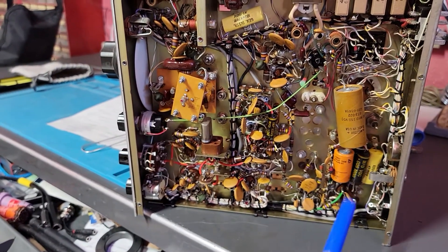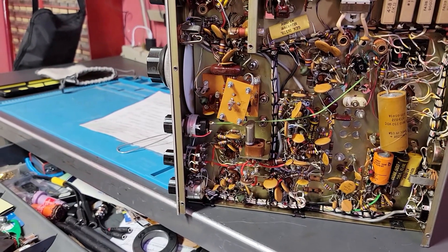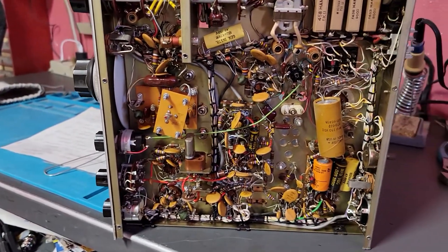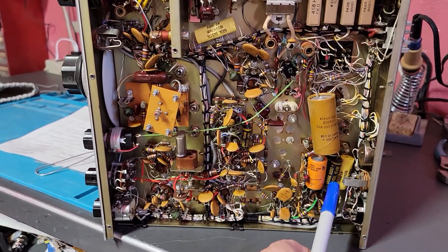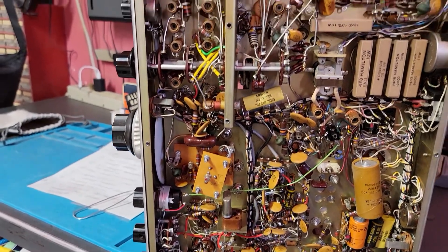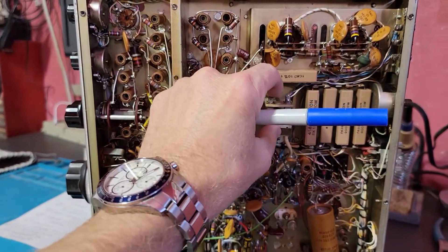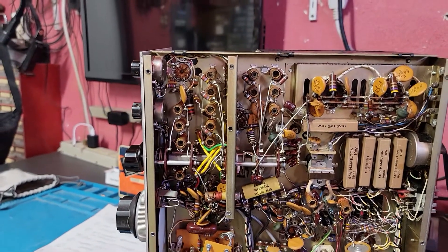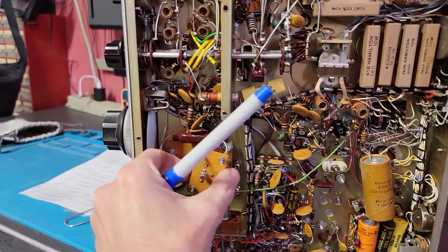A lot of Swans have those. I'm going to do a checker on that and see what it shows, because I don't know if I have one around. It says 20% tolerance so it doesn't have to be exact, but the voltage rating is the thing I might not have. One of the relays — push-to-talk relay — seems okay. I don't see really any modifications, which is kind of what you're looking for. No crazy mods.